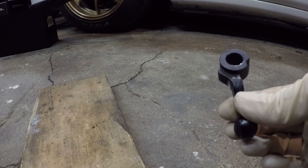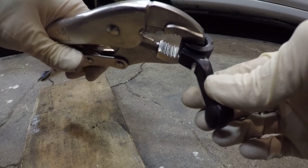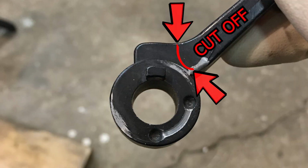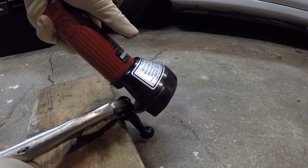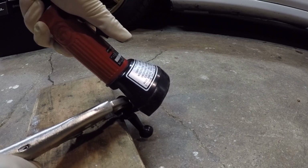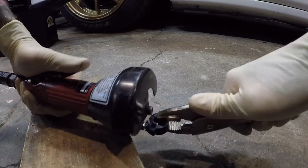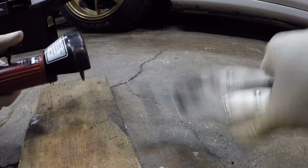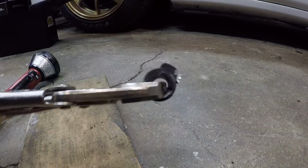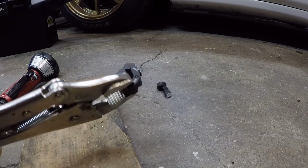You want to cut the majority of the bolt handle off the base. For a reference, I cut around here, so there was a lot of material left on this section for tapping threads. Take your time cutting off the bolt handle section. Once you are done, it may look a little rough. I decided to use a grinder with some cookie discs to clean it up a bit.